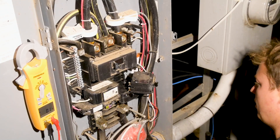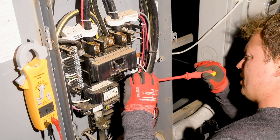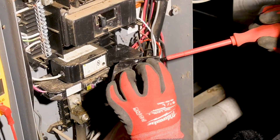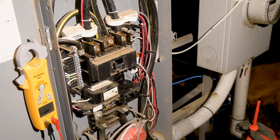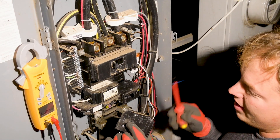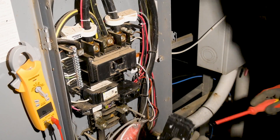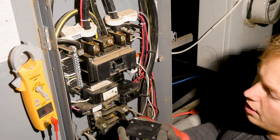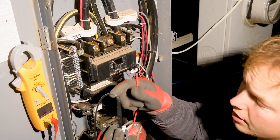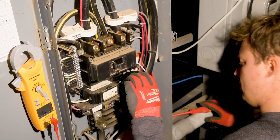What I'm going to do right now is just disconnect power from our power inlet box right back here and we're going to hook up a new breaker. I'm curious if it's possible that we wrecked this breaker, but I really just don't think so. I can see some evidence of critters kind of going in there. When you hear a weird sound while you're in an electrical panel, it really is freaky. Bad breaker — let's go grab a different one. I have a breaker that was just being used in a different location. If we go to our continuity mode, we can test when it's on between one leg and one leg — we have continuity on both sides. So we know this breaker is good. I think the other one just got damaged by something. Just a really weird deal. We'll go ahead and snap this in.